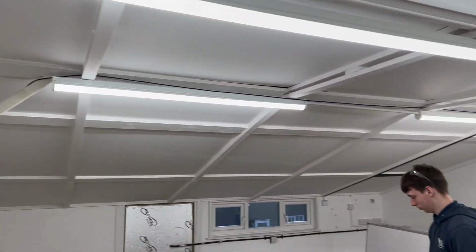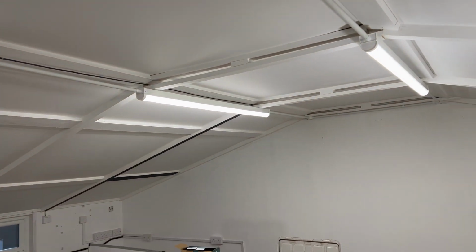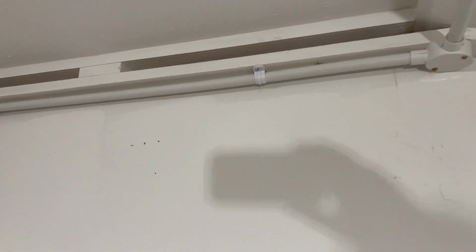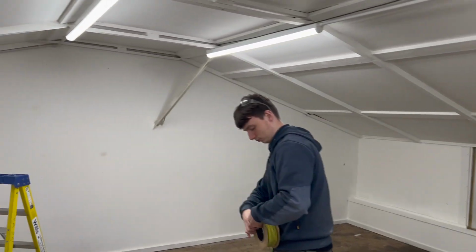Right, so that's all them swapped over. That makes a hell of a difference, doesn't it? I know we should probably support them. We was going to do it in Copex, but you ain't never going to get the sets because they're all different heights. But we did extend it and bring it down across here where it has got the clips here. It's under a metre between the lights and the earth, so this is going to be absolutely no issue. And that is absolutely perfect.